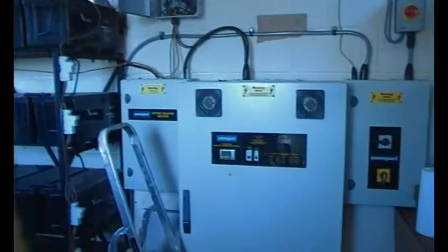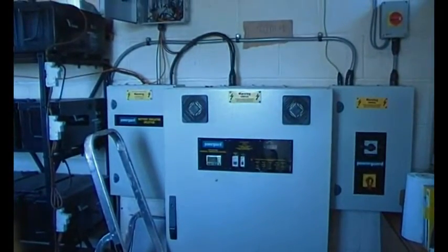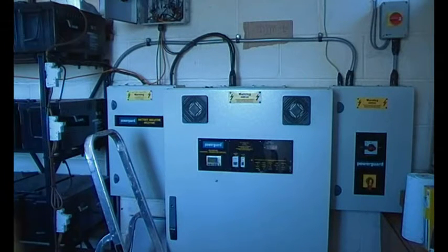This unit is quite reliable and it's got two inverters in it, each of three kilowatt. The second inverter switches off after half an hour if the load is relatively low. Each inverter draws three amps to run itself, so although it's very reliable, it is a bit power hungry.